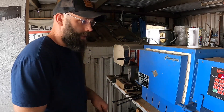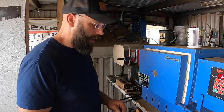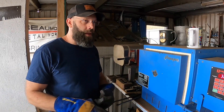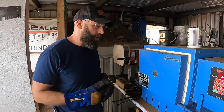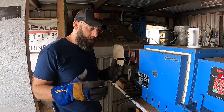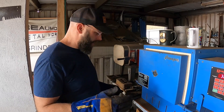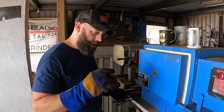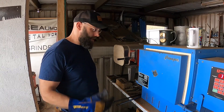I'm getting ready to quench the next three Fire Creek EDCs. What it really comes down to is pairing the type of steel with the intended application — that's really important. There is no one steel that does everything really well. For my heavy-duty chopping knives I like 80crv2 because it is super tough as-is. I can heat treat it with a homogeneous piece of steel and a homogeneous heat treat and get excellent edge retention and excellent toughness — based on that particular alloy.